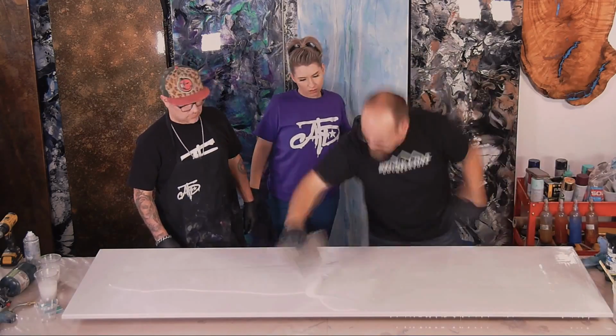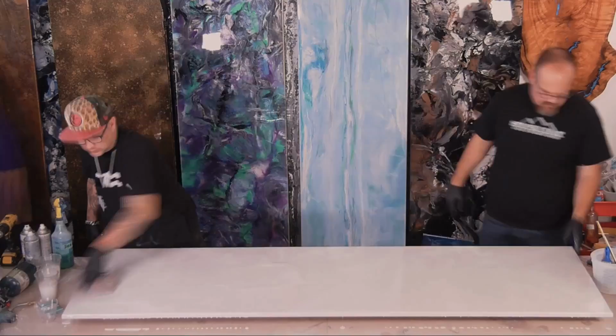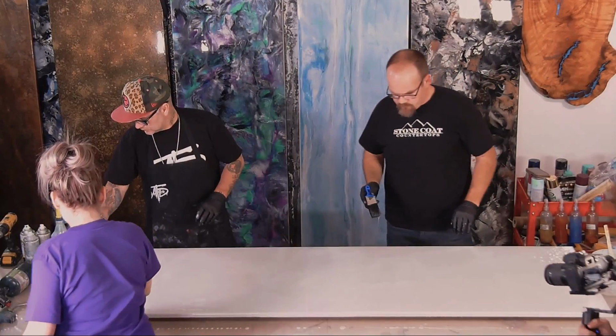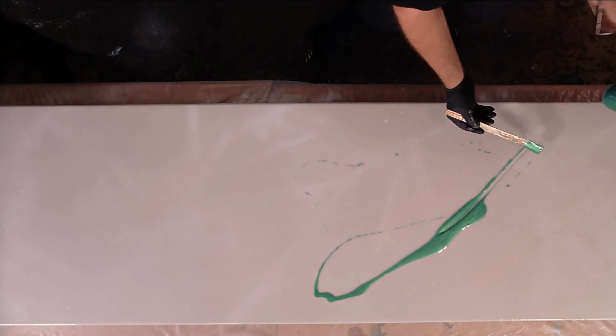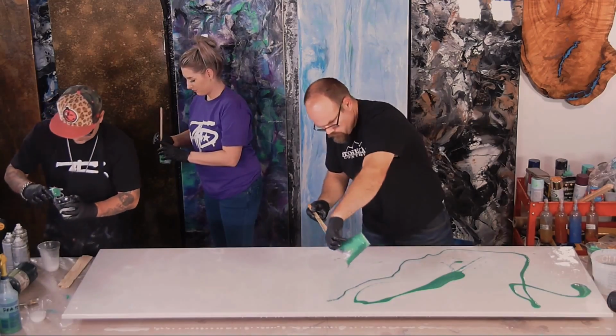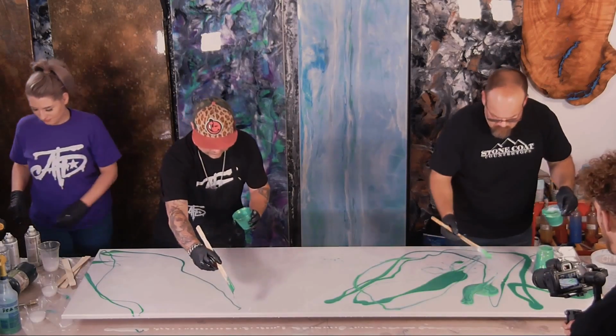Using the trowel, we'll spread the epoxy, starting from the middle, working our way out towards those edges. After we've spread the entire surface, we'll use brushes to chop the surface as well as paint those edges. Using our Stone Coat Countertop metallic additive, Real Teal, we're creating this beautiful jade look. We simply added some of that Real Teal to our cup and we're spreading it out randomly.